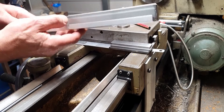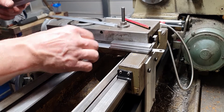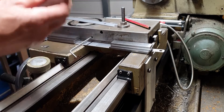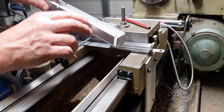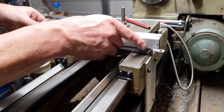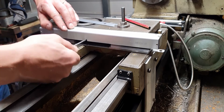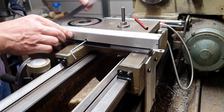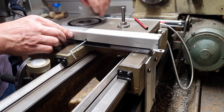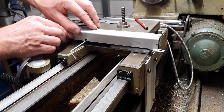I've machined the slot to allow us to lock off the top slide when we need to. I've had to build this up with some parallels and some steel rules because the bracket is a different height to the scale cover. Once we get that sitting on those parallels, we've got enough room to lock the top slide. We also need to be just below this surface because the compound swings around here and overhangs, and we're just about under that level.